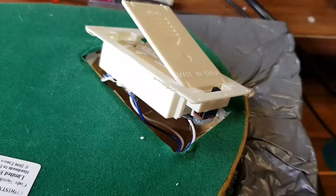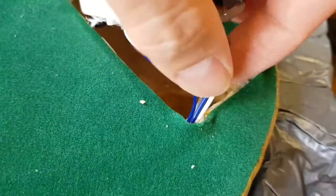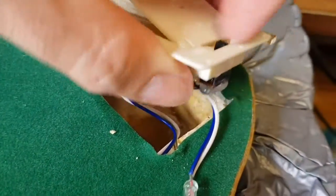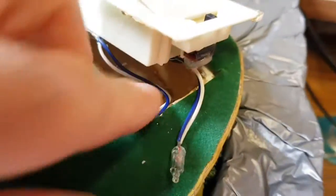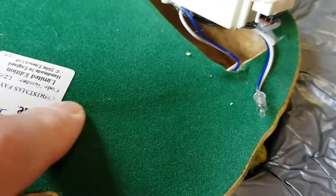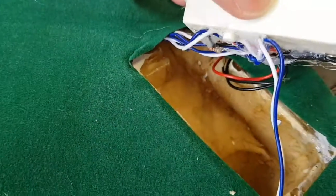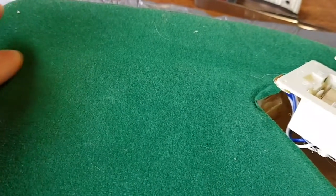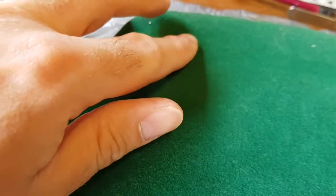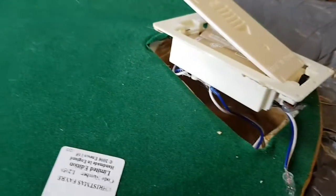The first thing to do is take the battery pack out and see what we've got. The battery pack is out — you can just get it screwed off and prise these out; the glue isn't very strong. Right down here there's a wire already there. We turn it on and see that bulb doesn't light, so that's one of the blown bulbs. Then we just have to find out where the rest of these wires go. You can feel it runs around here to about here, so there's probably a bulb here and here. You can see the wires going this way, feel a channel going down here — there's something here and something here, so I'll probably have to cut around here to find out what's underneath.